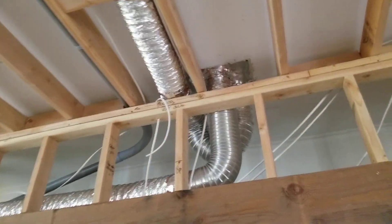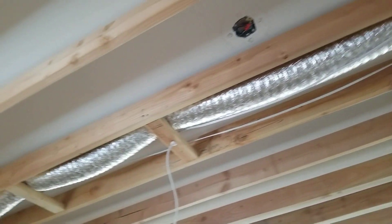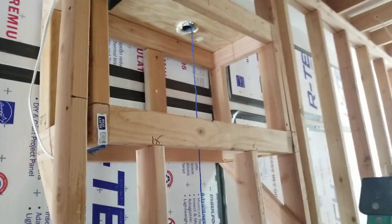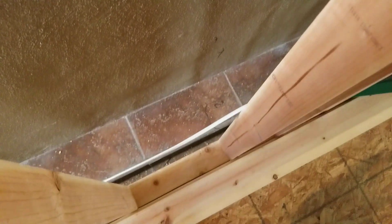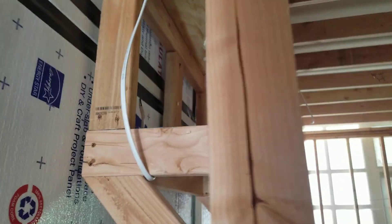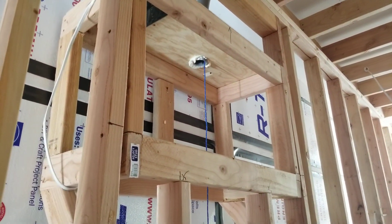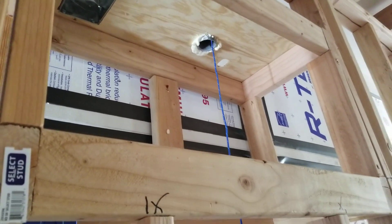Looking up above the stage, I've got a really quiet exhaust fan — a bathroom exhaust — and two sets of ducting. One of the ducting runs goes all the way through the top of the ceiling and down into the projector housing. The projector is actually set back behind the main wall because I had a funky ledge back here and a step down, which was causing me to lose approximately 14 inches due to the floor setup. So what I decided to do is come straight up with the wall, but make the most of those 14 inches for the projector — we've pushed it back about those extra 14 inches to get the extra throw I need, because every inch counts if I want to get up to that 130 inches. The exhaust ducting will pull heat off the projector.